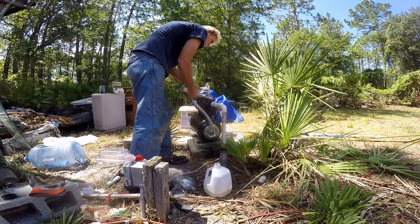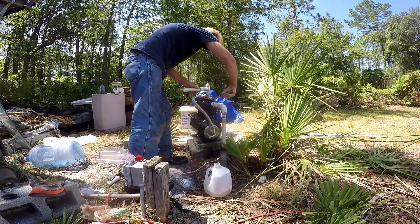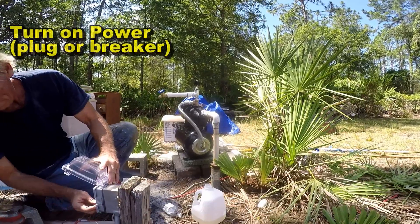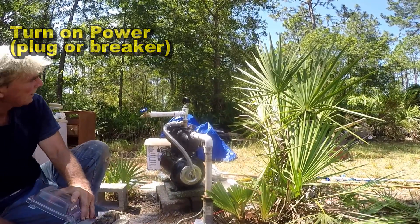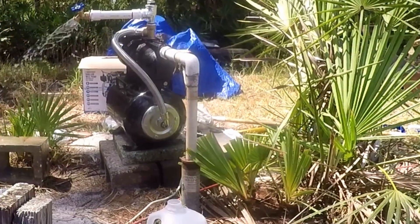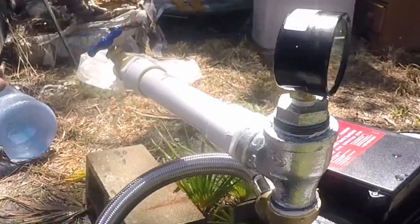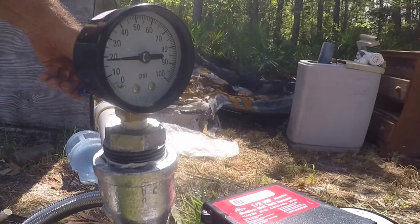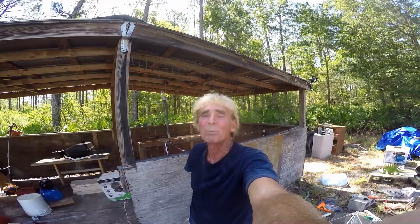It's working great — just got to prime it really good. Let's see what kind of pressure we've got. Almost 40 pounds and it shuts off. As pressure drops, let's see if we can get some pressure to drop here — oh yeah, it's dropping quick, should kick on — yep, comes right on. We got water! Setting up the shallow well pump is not so hard, a little bit hot down here in North Florida in the summertime, but this is Chuck with Apple Drains reminding you that if you believe you can do something, I guarantee you can do it. Have a great day.